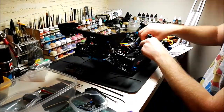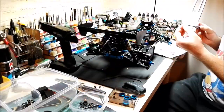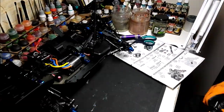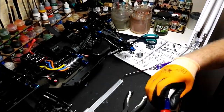The kit comes with the double-sided tape, which should be used to mount the ESC in the model. Unfortunately, in my case, I don't know why, but it doesn't hold it in place. It was ungluing all the time. So what I've done was taking Shoe Goo and using it to mount the ESC to the model, and it is working great, no problems at all.